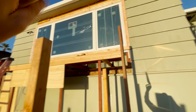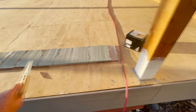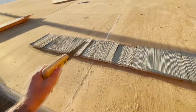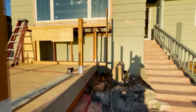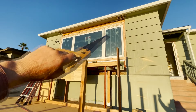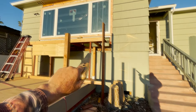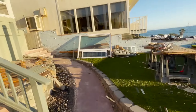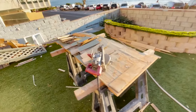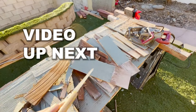I'm cutting all the shingles to fit right above the window. These are a certain thickness all the way through, and I'm laying them out on the ground, then I'll take them up and attach them with galvanized nails. I'm pre-cutting everything on the ground. On the bottom we also have to fill in all the shingles. I have a cutting station right here — we saved all the shingles and these big panels.